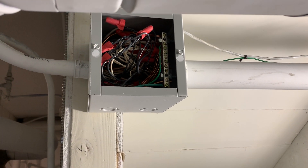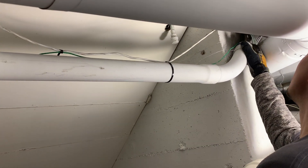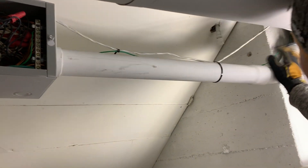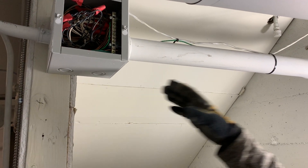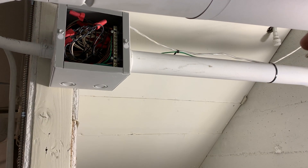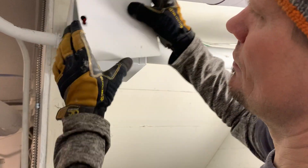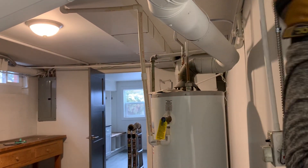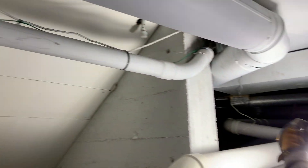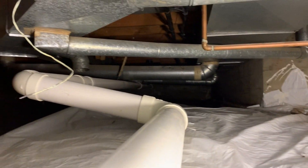The guy that did the work did a really good job. I know this isn't commercial — this is residential. But how many romex runs can you fit in there? Well, this guy fit 2, 4, 6, 8, 10, 12, 14 — so maybe he's got around 20 conductors in there. Well, how many current-carrying conductors in a conduit? You should run 4 three-quarter PVC's or maybe 4 one-inch, but the bottom line is it's never going to overheat — it's a house, not a building. He piped this all the way 1-inch to that top panel there, pulled the circuits, and did the backside of the addition. I ran that wire around and through. You can see down there is about a huge cave, and that went all the way back. 35 feet over that way is where my TC cable went.